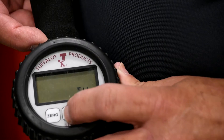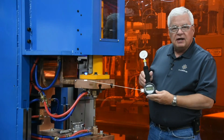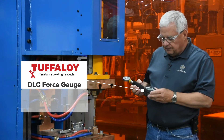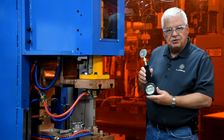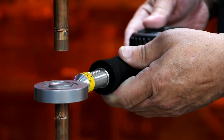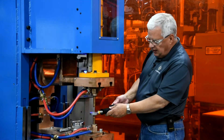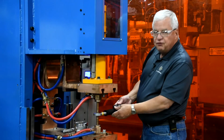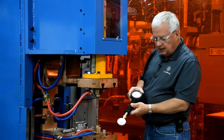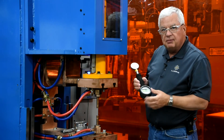We do have to turn on our digital force gauge and let it go through its booting process. I've got a 5,000 pound digital force gauge here. They do come in different increments — if you need a lower capacity, we have those as well. Now I'm ready to test how much force we are putting on our electrodes. I'm going to put my load cell in between my electrodes, make sure my hands are out of the way for safety, and come down onto my force gauge just like it was going to weld. You can see that we are showing a force reading here. This force gauge allows you to hold the last force that was read so I'll be able to read what it was.